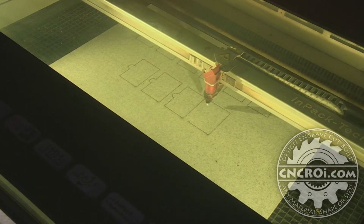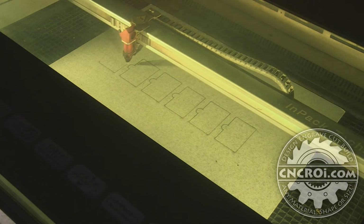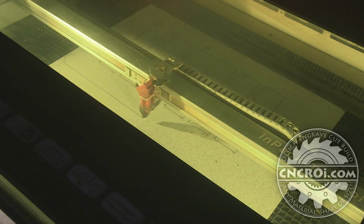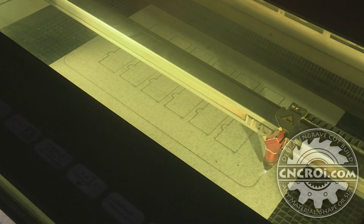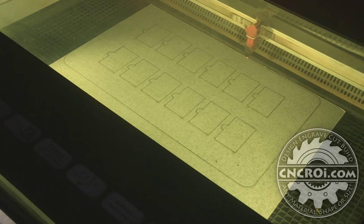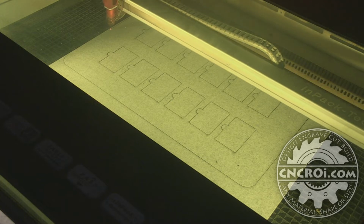There's very little area to glue or bond the 2 layers, in this case here, together, or it's just going to break in shipping, or it's going to break at their end. Because it's not necessarily the owner of the company who paid for this jig who's going to be using the jig. It might be dropped on the floor or whatever. So you want to leave a lot of support material all around it to give it a lot of structural strength. Now, of course, you can have different components across the jig. So one section is golf balls, one section's credit cards, or what have you. That's not a problem at all. But just make sure you leave some room all the way around the different components and between the different holes that we make for this specific jig.